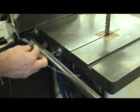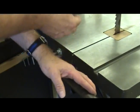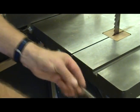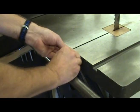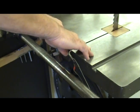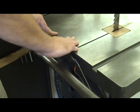A lot of people think the table pins are just to keep the blade from falling out, but they're much more important than that. If you leave that little pin out for any length of time, this side of your table and that side of your table won't stay coplanar. And that's really important.